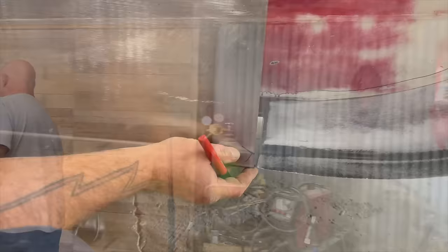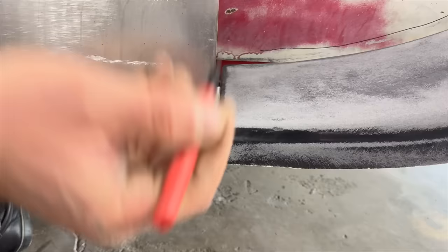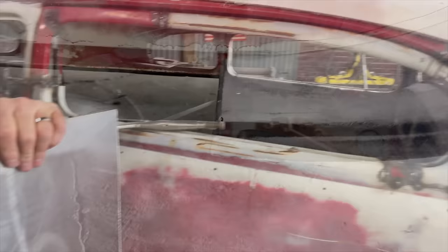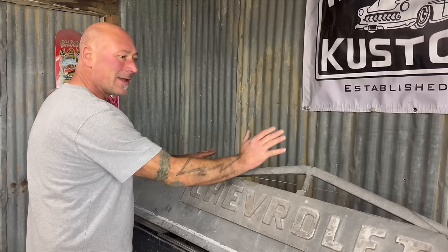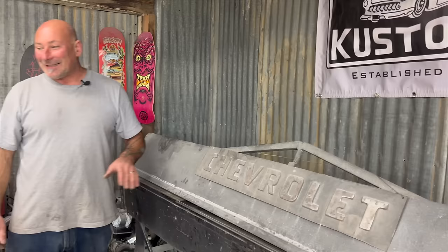Second part — we're going to go back and compare. See, now we have that detail falling straight through. But we're going to want a radius bend through here, so from about there to about there, probably even a little bit tighter. I'm going to transfer those lines to the back side again because we're going to want to turn around the corner. With a sheet metal brake you have to work from the deepest — the material being as deep in the tool as possible — because you'll get trapped, you won't be able to insert the work part into it, it'll want to smush that. So you always got to be thinking about doing things in the right order. It only goes in and out one way.